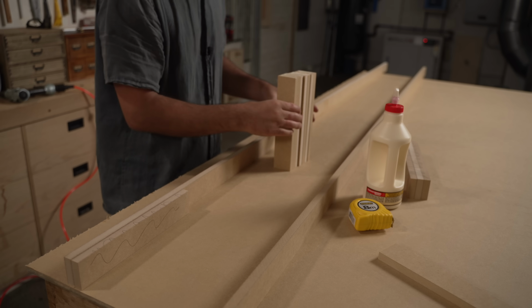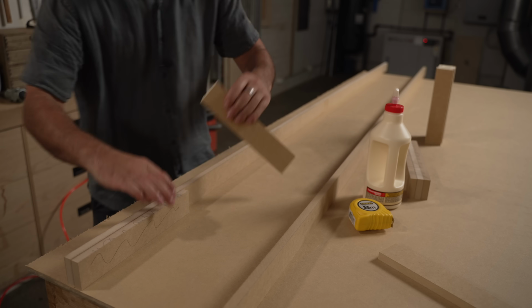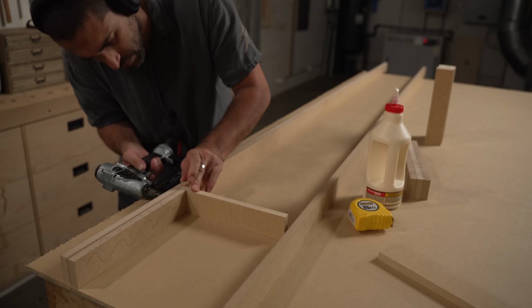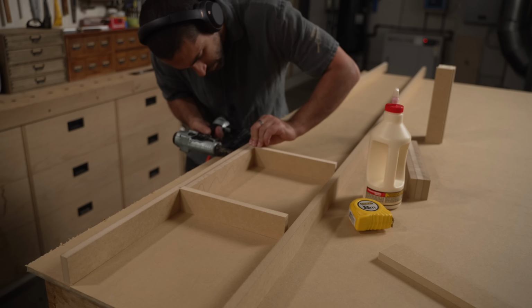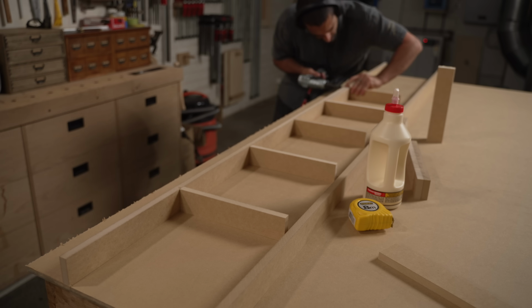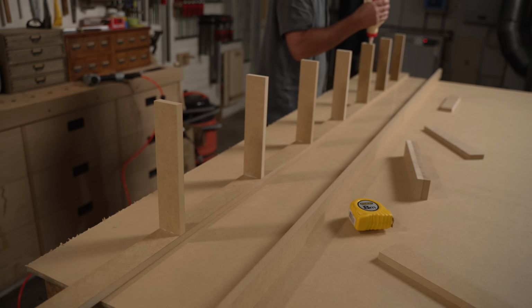What you've been watching me cut up are the components for the first workbench, which I'm assembling using a torsion box technique, which is quite common. Basically, it's a grid pattern that gets sandwiched between a top and bottom layer, making a very strong tabletop, which is important because that tabletop is 2.6 by 1.4 meters.